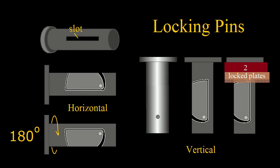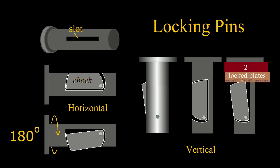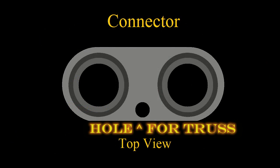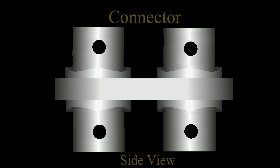They are held in place with this type of universal pin. You put it in the holes that line up and it automatically locks them together. These connectors can be all identical throughout the height of the building, except where angles are needed at corners. There, the hole in the plug for the pin must be turned so as to match up with the hole on the cylindrical girder that mates to it.